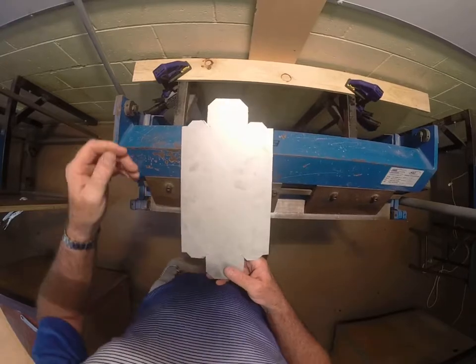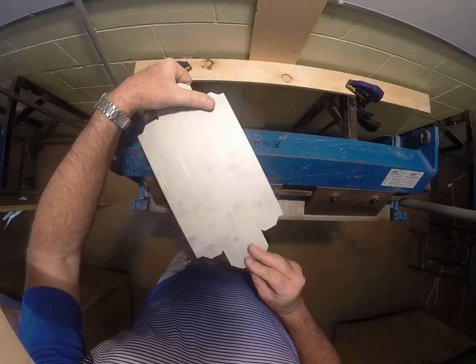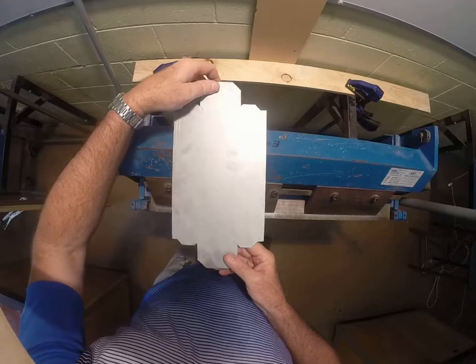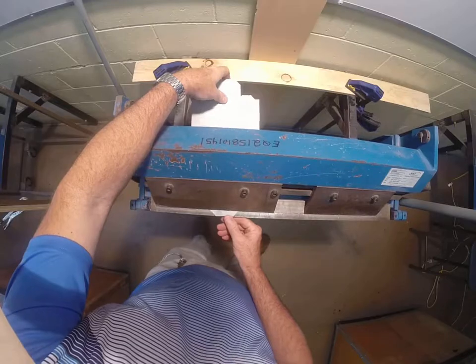In this lesson we're looking at folding our safe edges and rails. We need to ensure when we start folding that we have it on the side which does not show our 50mm base edges, so we turn it over to the opposite side when we put it into the machine, so that the entire material is all the way in.